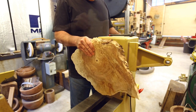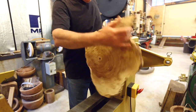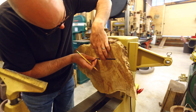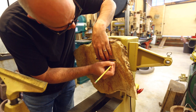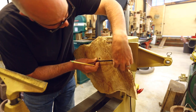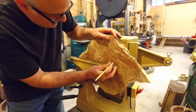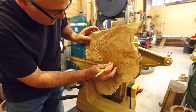I remounted the piece on the lathe, and it just fit. The two faces of the piece of wood aren't parallel, so the thought I had was to base everything on the back of the piece of wood — mount the face plate on the back, then turn the front, making the turning parallel to the back so that it wouldn't be parallel to the front. So I wouldn't get a round turning; I'd get sort of a dished shape.